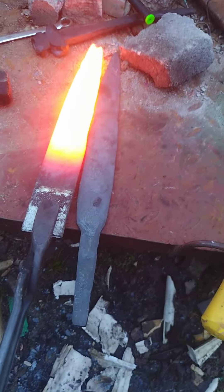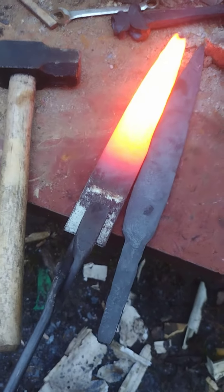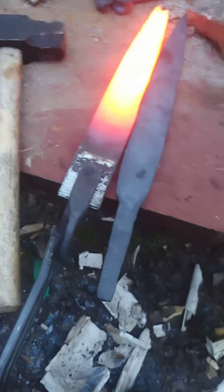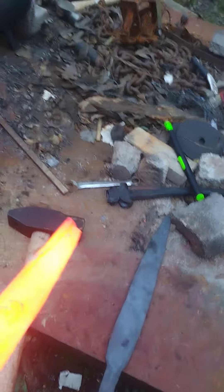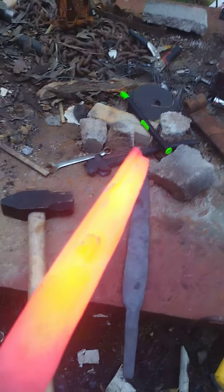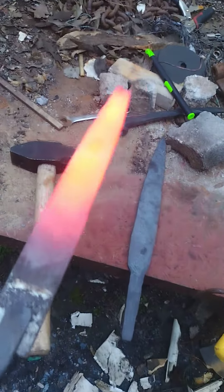What I'm doing is comparing them to see where I need to go next. This part up here by my tongs, I'll smash it down and work that steel out — that'll be my tang. The tip was where that hole was in that leaf spring where I cut it in half, so I'm going to have to work that down. You can see it's still rather thick.